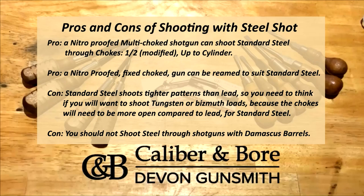So if you're wondering what you should be doing with your nitro-proofed multi-choke or fixed choke shotgun, and should you be using standard steel with it, or do you need to buy a new steel-proof gun? Let's look at some of these pros and cons of shooting with steel shot. One of the pros of a nitro-proofed multi-choke shotgun is that you can shoot standard steel through chokes from half, which is modified, up to cylinder. And another pro is if you have a nitro-proofed fixed choke shotgun, it can be reamed by a gunsmith to shoot standard steel.